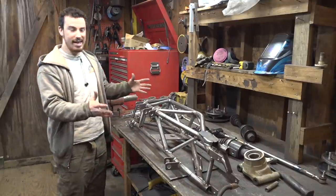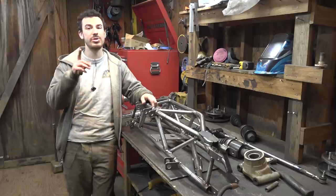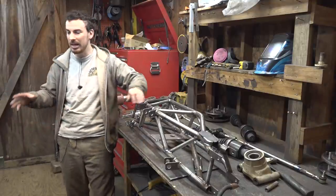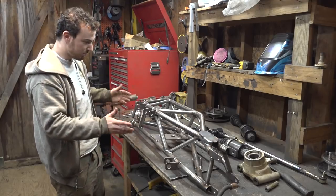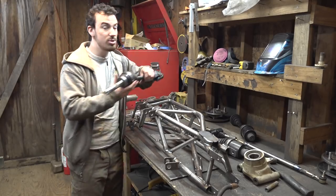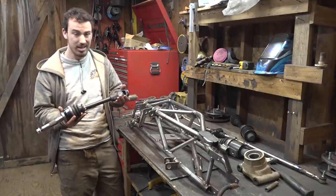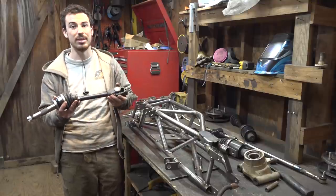Just finished welding the axles together. Now, I was gonna start working on reassembling this thing, but I also wanna finish the drive setup in this video. The CV axles, as well as the drive shafts, I wanna lengthen them and weld those together as well. So I think it's gonna be a little easier to do that with these on the table versus on the floor. Now, for the front, it's gonna be a little bit easier because the front just uses the same CV axle because the differential and the hubs on the front are from the same vehicle. I already cut them in half, we just have to figure out the spacing between them and weld something in between.